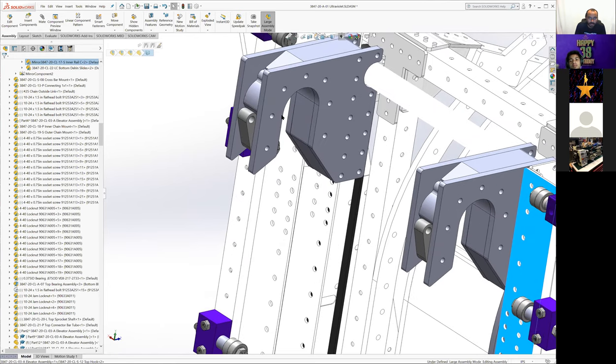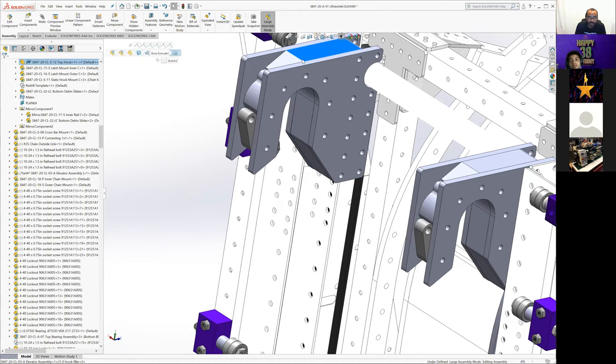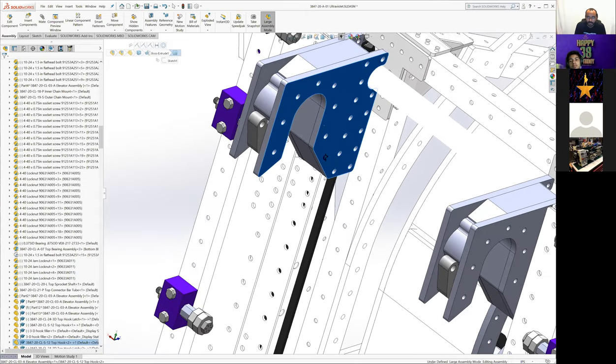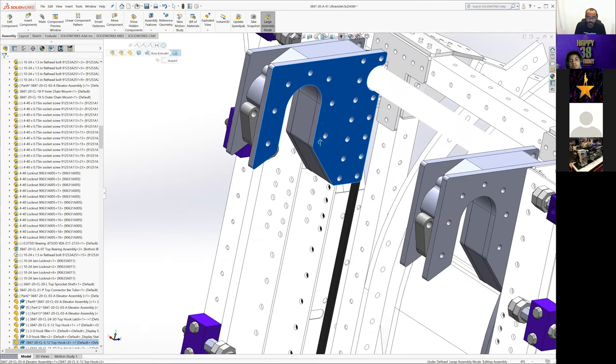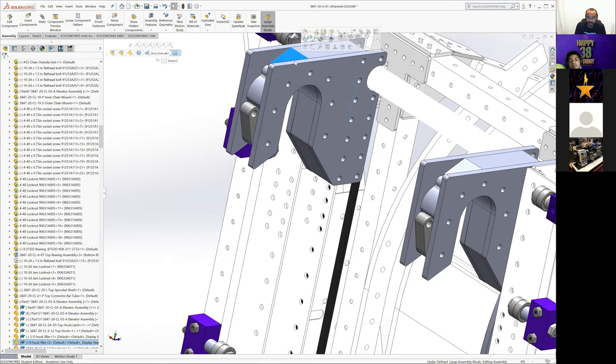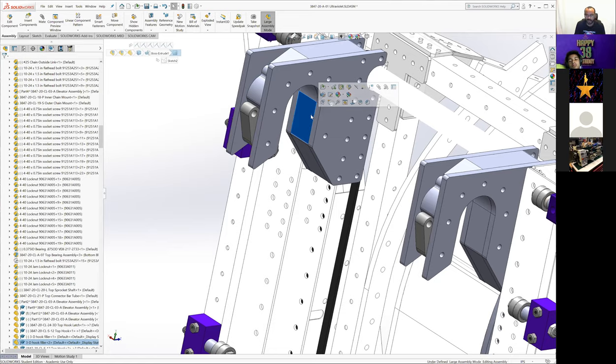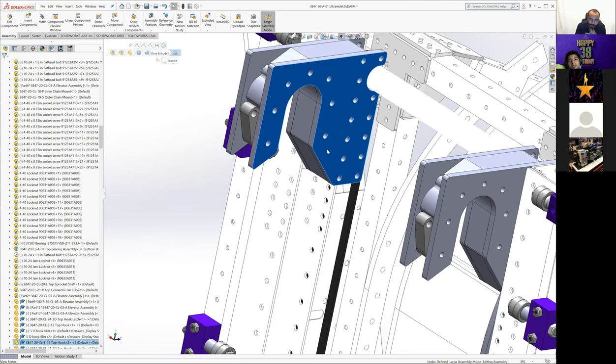Let's see what else. So these are aluminum plates with a 3D printed part on the inside, and then an aluminum plate. I think the version we actually ran at Dripping Springs, what was it? It was only like 1/8-inch plate or even 0.09 plate. 0.09 plate with standoffs, right? Spacers. Yeah, because I don't even think we got to the point of 3D printing. The 3D prints we printed right after Dripping Springs never got fully in there. And that caused all sorts of issues as we started bending those 0.09 plates a lot. So the next plan was to make these thicker and have a 3D print reinforcement so it's harder to bend.